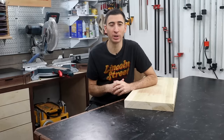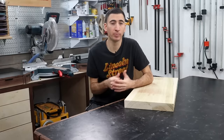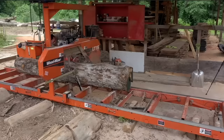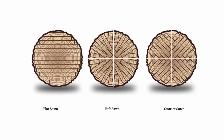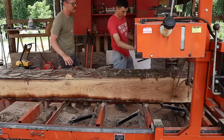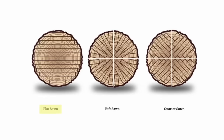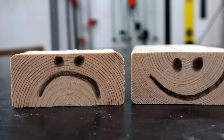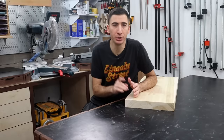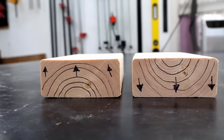If you don't alternate growth rings, your panel will not stay flat. This is a fun one. Trees have growth rings, which is what you see on the end grains of your wood, and depending on how boards are cut from logs, the orientation of those growth rings relative to the face changes. The cheapest and fastest way to mill up a log is called flat sawn, and this results in end grain that looks like a sad or a happy face, depending on which way you hold it. When the wood dries and shrinks after it's milled, the natural tendency is for the wood to cup in the opposite direction of the growth rings, away from the center of the tree. Those rings just want to lay flat.